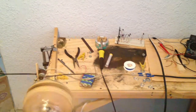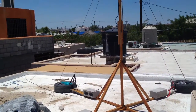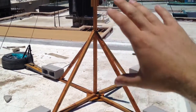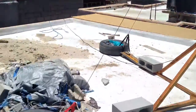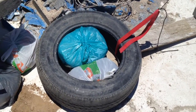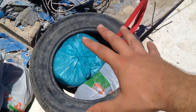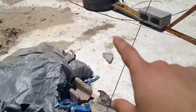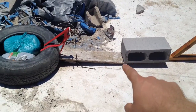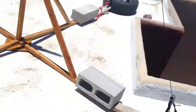It's nice and windy — you can see all the trees blowing — and the wind turbine tower is ready for a wind turbine on top. I got these tires for free at a local tire place; I filled normal grocery bags with sand — also free — and I have two bags each but I'll put more on top. There's a wood frame so the weight sets down on the rubber and creates friction with the ground. These four are the anchors for the guy wires, and I wedged wood under here with a rock so it won't move in high winds.